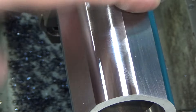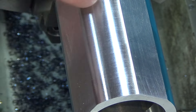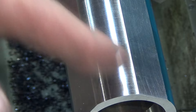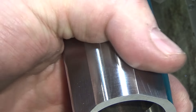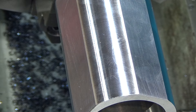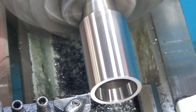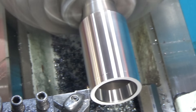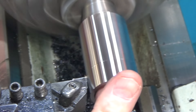This method is yielding a much better finish. Even at a high feed rate I'm getting a decent finish — I can feel it with my fingernail because it's winding like a screw at nine thousandths of revolution, but it's coming off nice. I'm not rolling over a burr on the edges anymore, it's just really clean cutting. I'll keep it up and bring you back when I get closer to round.